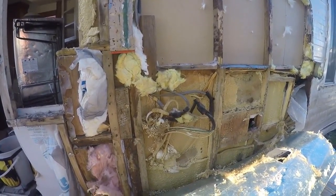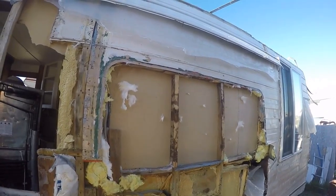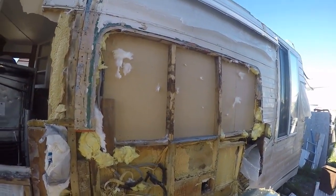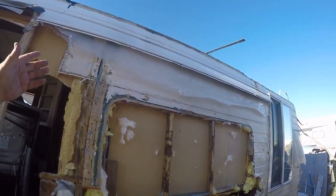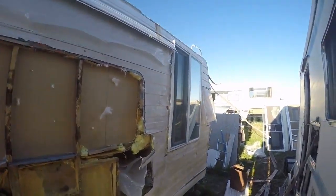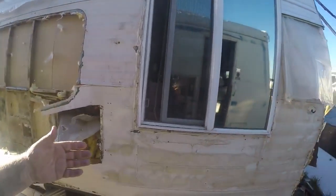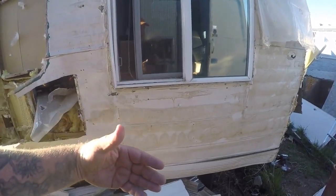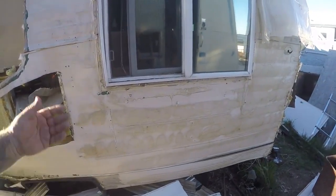This used to be a window — it was all filled in. He'd completely filled that in with insulation and had it covered over with aluminum. He had visqueen or plastic sheeting over the outside as a thermal barrier and a moisture barrier. You can see how all this was wet underneath that plastic — when I took it off, everything was holding all this moisture inside, trapped between two pieces of aluminum.